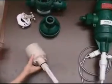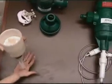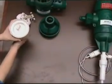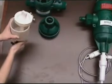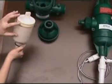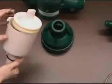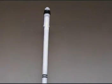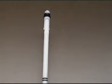Instead of rubbing against the outer casing, the long-stroke Gator motor piston slides in a replaceable cylinder sleeve. In addition, the motor piston has soft, resilient sealing rings to minimize any scratching from abrasives in the flowing water. The two O-ring seals on the motor pump connector stem keep the chemical in the pump section separate from the water in the motor section.